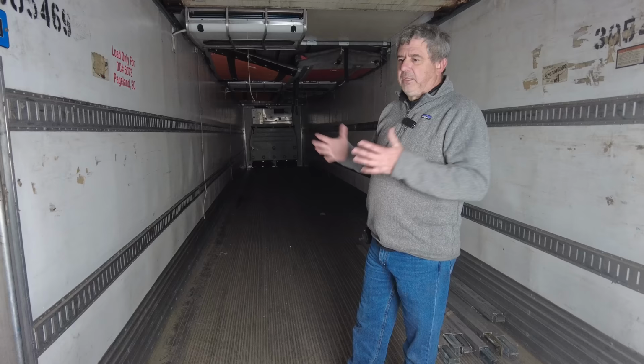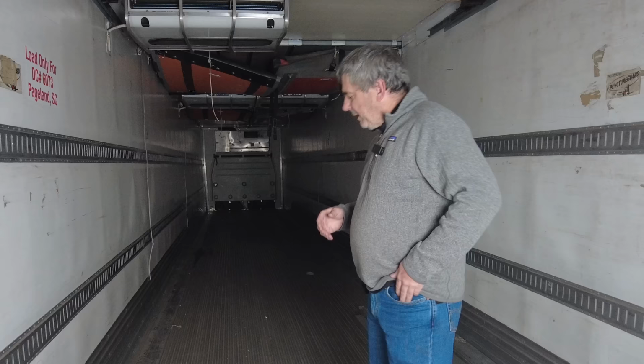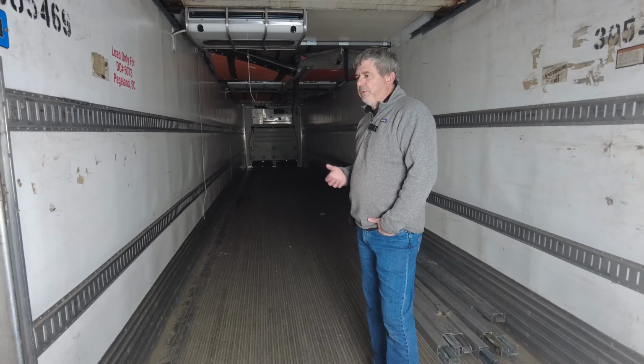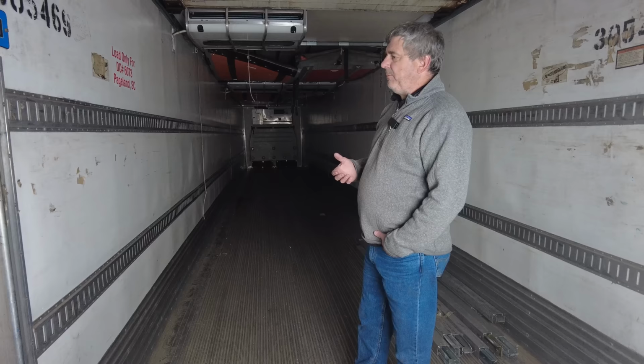A lot of those big RVs, even the fifth wheels, only have like 2,000 or 3,000 pounds of capacity beyond what the trailer's rated for. That's one thing we like about it. So we get a good safe platform that'll take us down the road. These trailers are designed to do millions of miles, and we get them when they're 5 or 6 years old, put new tires on them, redo the brakes, redo the axles, and we've got a brand new platform that's only going to do, you know, a couple thousand miles a year for us anyway.